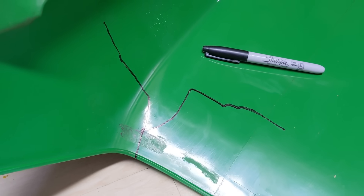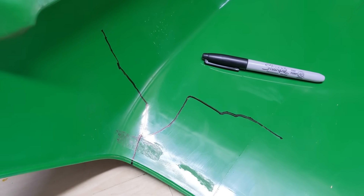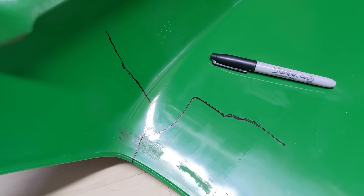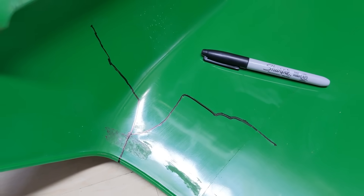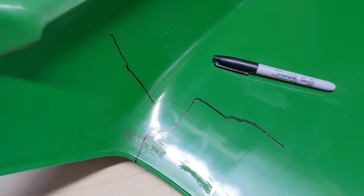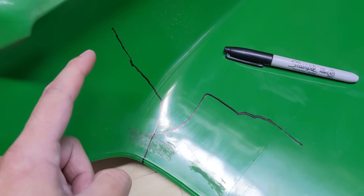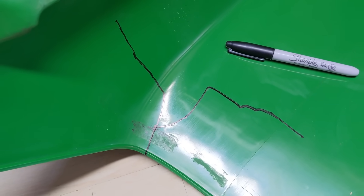Just to note: if we were working with metal and had a crack to weld, the first thing you'd want to do is drill out where the crack ends. If you take a welder to a metal crack and just start welding, that crack will want to open up and keep expanding. You need to stop the crack by drilling a hole at the end, tack weld the holes in, and then continue — that prevents the crack from spreading further.